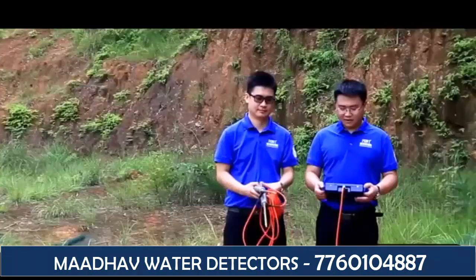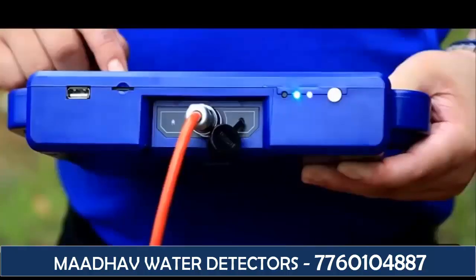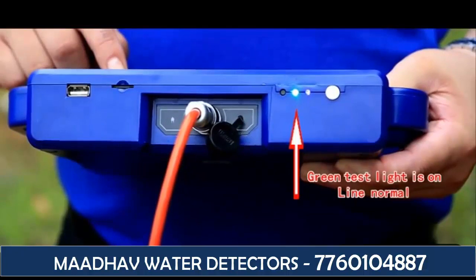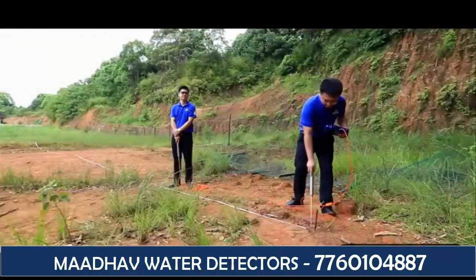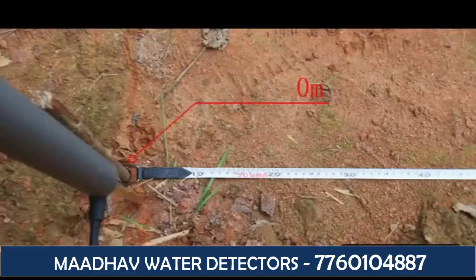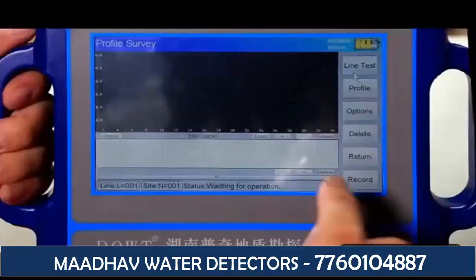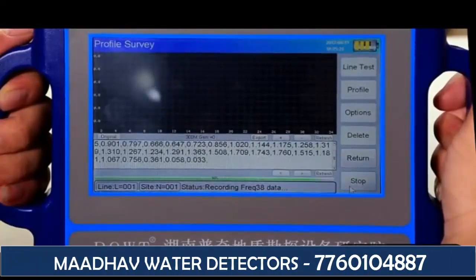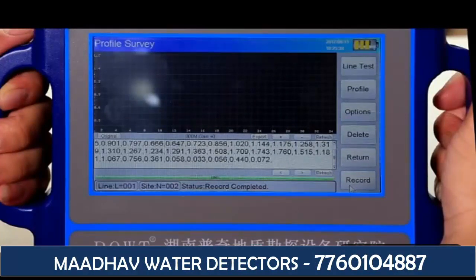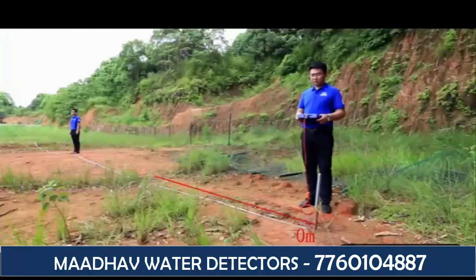The third step: cross and put the two connected electrodes together before sampling, then click line test on the instrument. When the green test light of the instrument is on, it indicates that the line is normal. Next, we use 10 meter electrode equidistance for measurement. Insert one electrode near the host into the tape position of 0 meters, and insert the other electrode into the tape position of 10 meters. Click the record button for measurement of the first point. When data acquisition is completed, the instrument display will notify 'record completed,' accompanied with a voice prompt. Please note that each measurement point is in the middle of the two electrodes, so the first measurement point is at the position of 5 meters.